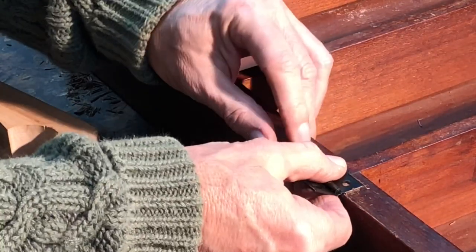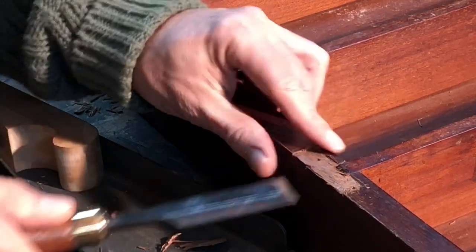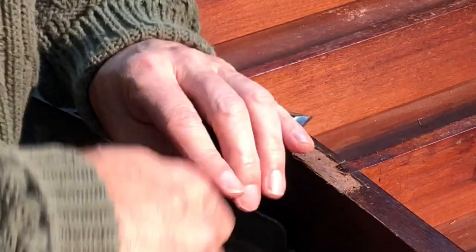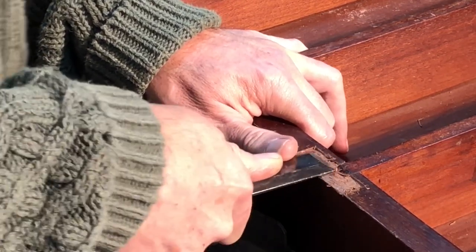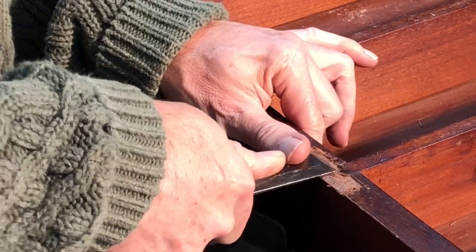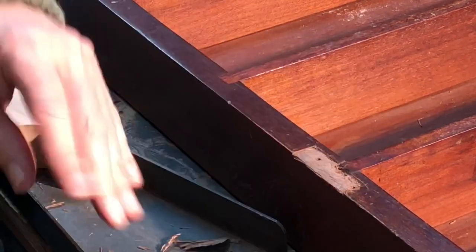So it's important often to check and see how you are. We need to go a little bit wider. There. It's easy to slip. So you don't want to be pushing a chisel towards your hand. In this case, I get my finger locked under there, and then I'm riding that back part to get whatever's high, but I have control. I'm not just pushing it through. I'm using this finger here against it to control it. And I'm slicing my way around. I'm not banging into it.